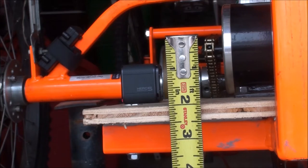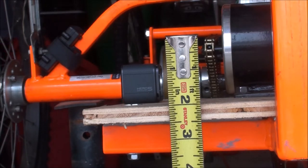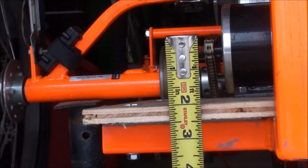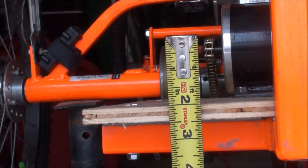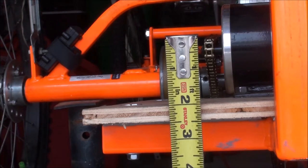We're going to show you the frame flexing issue. The only problem I encountered is the frame flexing, plus the motor plate is made out of wood, which creates a lot of noise. The bicycle is up in the air right now with no load on the tires, and watch how it flexes. When you've got it on the ground with load on the tires it's a lot worse. You have to ride it a certain way — pedal to get it going to about one or two miles an hour, then ease in on the throttle.